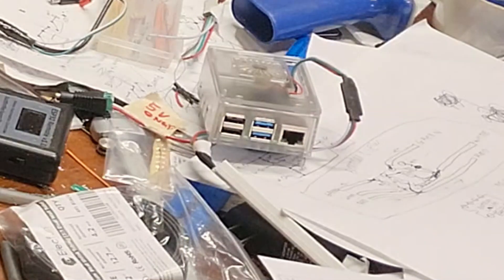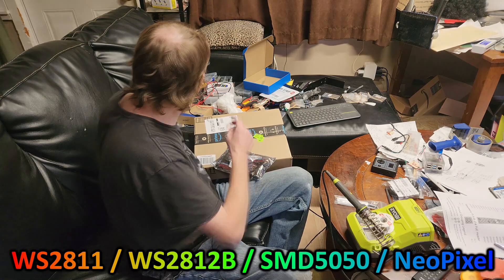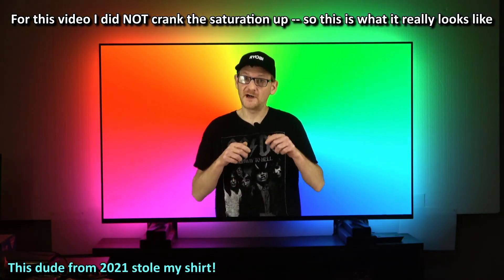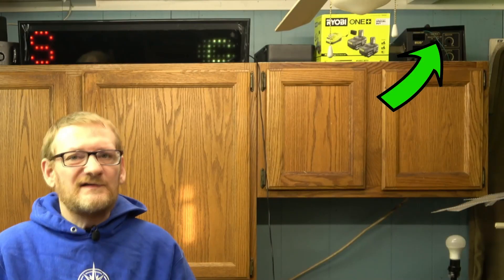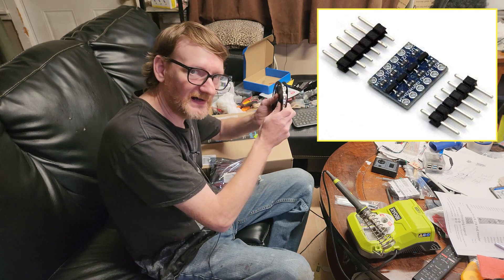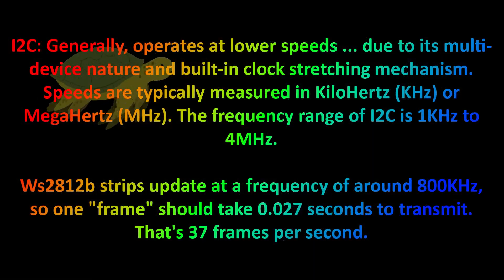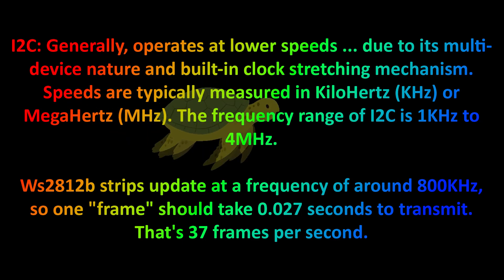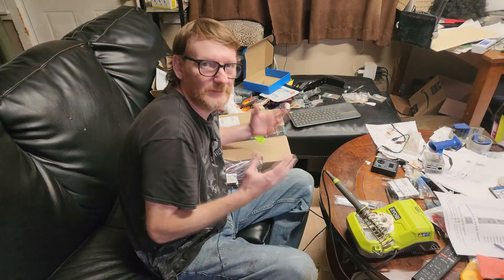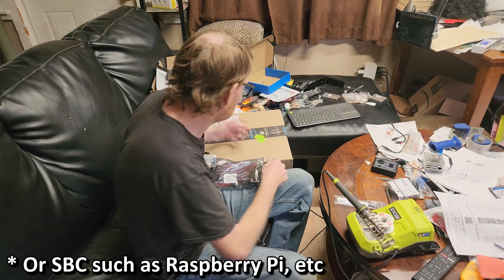I'm not going to give it all away just yet. Every time I've had to do a project involving LED strips — specifically these RGB individually addressable LED strips, like the Hyperion project for the TV, my scrolling marquee, all that kind of stuff — I needed some kind of level shifter. The ones you can buy, don't be fooled, most of those are made for I2C. I2C is a slow protocol; it's not fast enough to keep up with these LEDs. Those don't work, and they're bi-directional — we only need one direction since the LEDs aren't talking back to the microcontroller.